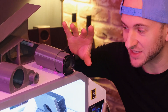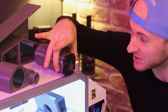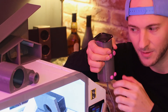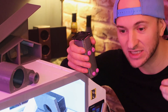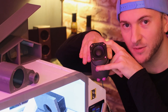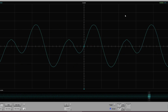I'm going to play 150 Hz, which is 25 scaled hertz. Wow, you can feel the air coming out around the ring here - there's a lot of port displacement. It has a slight buzz to it. The exact sound of the buzz goes away when I change the area of the port here with my hand, so I don't think it's a mechanical thing - I think it is actually something happening acoustically inside here. Looking at this on the Room EQ Wizard scope, it shows us it's not clean at all at this lower frequency of 150 Hz. We've got this mad harmonic overlaid and you can see the shape of the wave is horrendous.